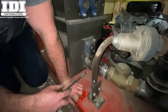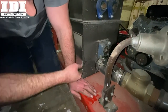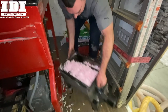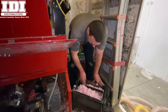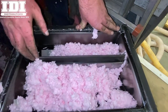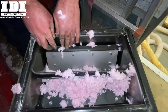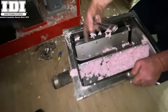We have better access to the hose from the back now and we'll be able to break it off the tube. We've got our airlock out. This right here is the seal — that's what we're going to replace. A lot of times you'll see tears in the top of the seal: nails, chunks of wood, or things that get in and tear it. These look pretty good, but you can tell they're worn because when I push on this airlock it rotates too easily. That shows the seals are worn — it's time for new ones, which will give a lot more air pressure.